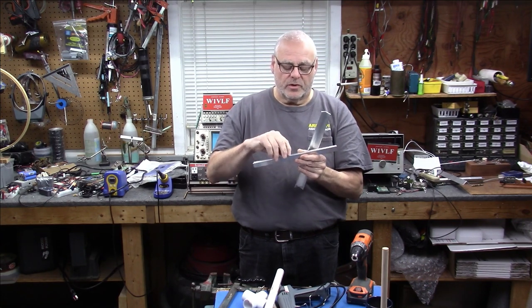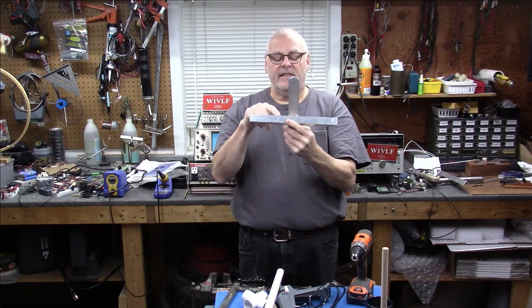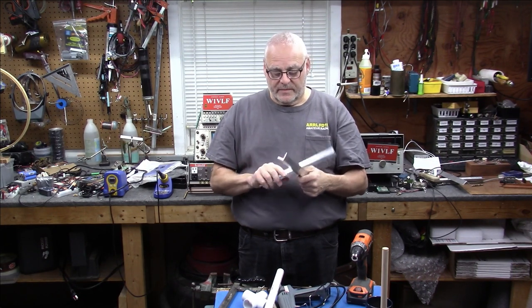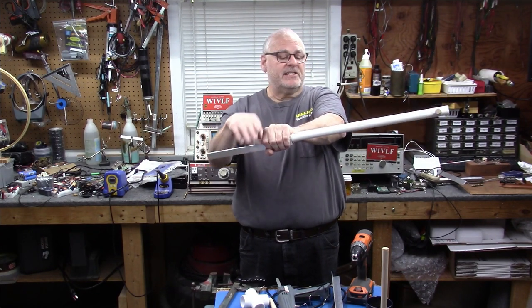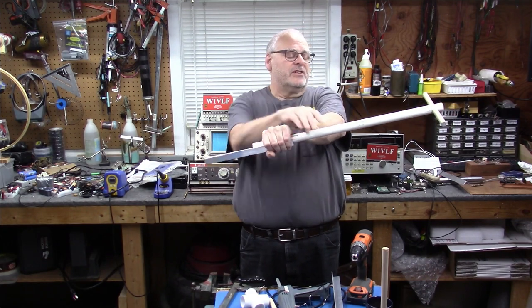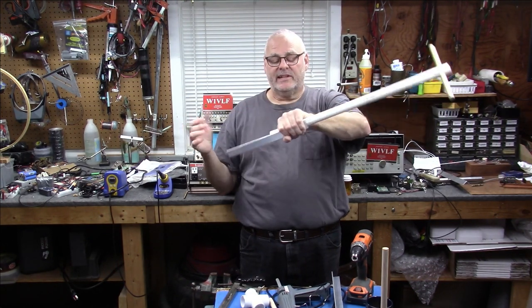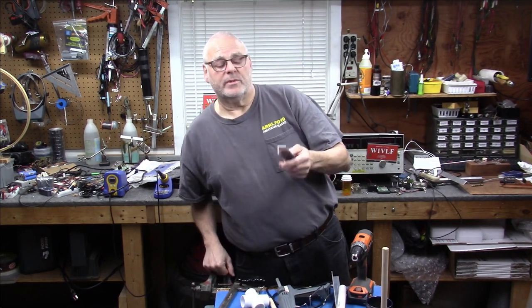So what you do then is you put a couple of little grooves, you bolt it together, you make sure that it's a perfect 90 degrees. And then you cut a couple of notches here and here. And then when you bolt this together later, those notches will lock this thing up solid. You'll see that. I'll put it together here in a minute. What that's going to allow you to do is to take your spreader and put hose clamps around it like this and align this with the arm going out that way, and align it with the arm coming towards you and the one going towards me, so that all of your spreaders up here will all be in the same plane, and you won't have put the thing together and have one spreader that's like that and one spreader that's perfectly horizontal. Now when you go to wind it, it's a real pain in the butt and doesn't work well. So I'll show you this in a step here. I'm going to take a quick break, bolt this together, and show you that a little bit more. Be right back.